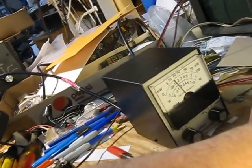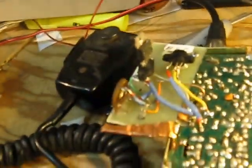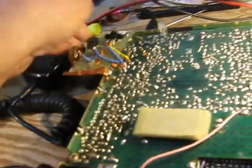About 1.5 watts — not bad. This is an old Uniden C2029-1, the original one I took out of this CB. I had solder extensions onto it in order to get it to fit back in that socket. It's up around 2 watts, which is about what I would expect.